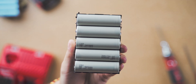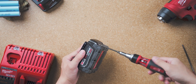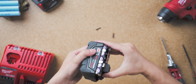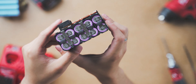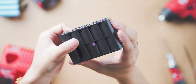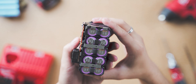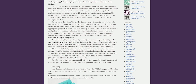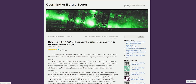Now let's take apart all those other batteries. For all batteries with two rows of cells, namely the XC batteries, there are only four T10 security screws. Once you unscrew them, the internal cell assembly should pop right out with some force. At this point, if you really want to look at the individual cells, you have to figure out a way to remove the solder connections without damaging them, but I won't recommend doing so since it looks really hard to put back. To identify each cell, we can just look at the color, physical dimension, end cells, and cap design. There are multiple articles on the internet that can help you find out what battery cells you have, and I'll link those in the video description.